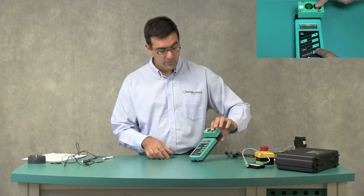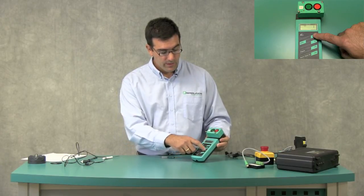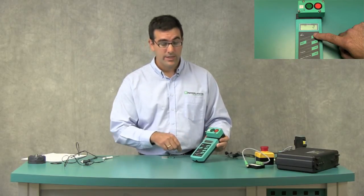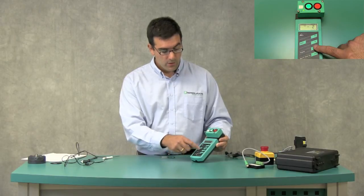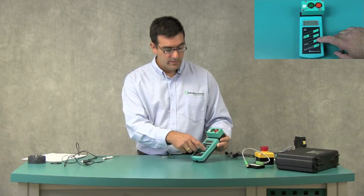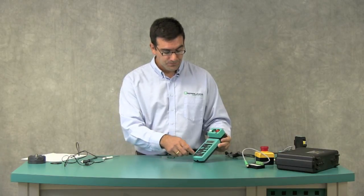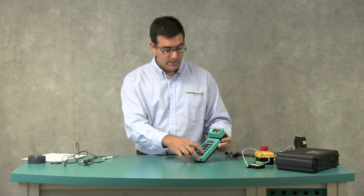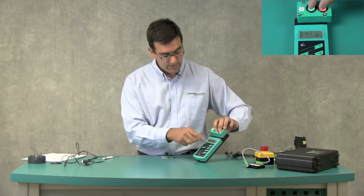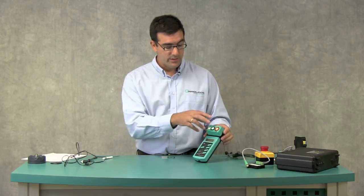You can see the number 4 is the third input. The outputs are actually one and two. I can arrow up to number one and hit program to set the outputs. If I want to turn that one off and turn on the green one, I change the number. Or if you want to turn all outputs on, go to the maximum value — in this case it's 7, or it might be F if it's a four-in, four-out module — and press the program key to turn everything on. You can also read inputs and set outputs simultaneously. It'll remember the programmed output; when you hit the address key and hold it, it'll keep them on. Press both buttons and it'll tell you the value of both inputs running simultaneously. It's a quick and easy way to set outputs and read inputs — a really nice diagnostic tool.